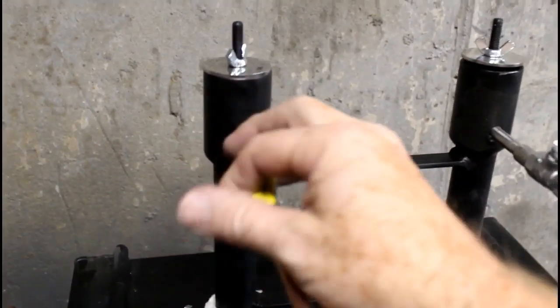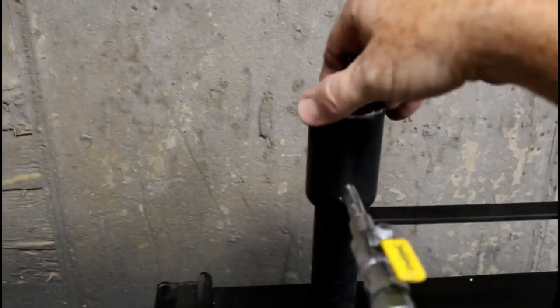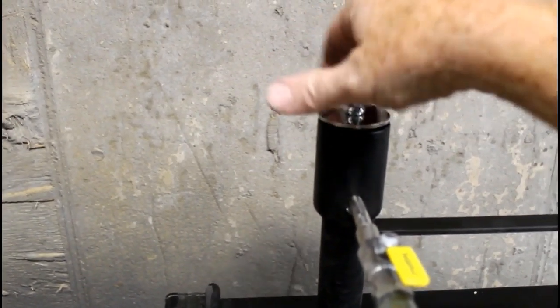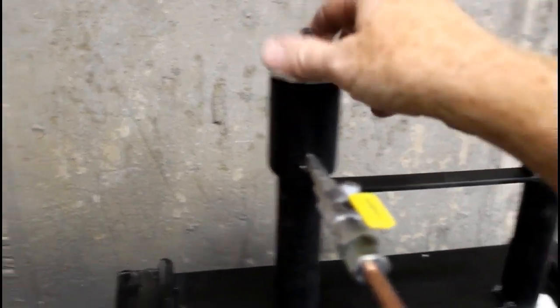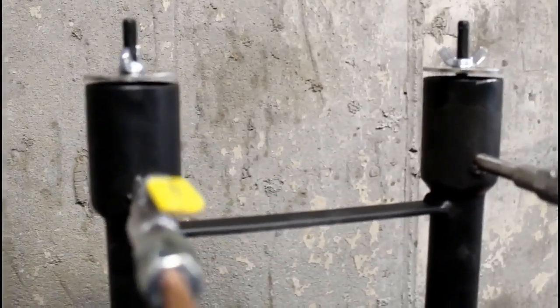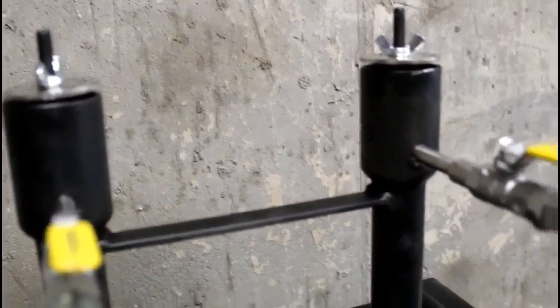The back burner, when I turn it on, I would correspondingly open the choke. And you want that choke to be open 1/8 of an inch to 1/4 of an inch. You're going to adjust it to get the nice blue flame that you're looking for. But whenever you turn off a burner, you'll also want to close the choke.